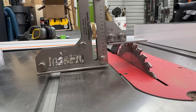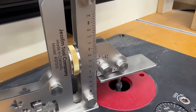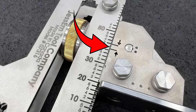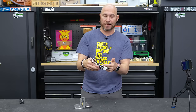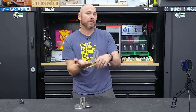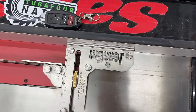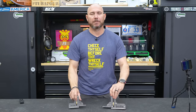These are setup gauges to set up table saws, band saws, routers, and router tables. You set your blade heights using the bottom of the blade on your setup gauge, because this has two different indicators — one for the bottom of the blade and one for the top — so they account for the thickness of that. You can set your gauge wherever you need it depending on what side you need. The bottom of the gauge is used for setting bit heights and blade heights; the top is for setting fence distances. I'm glad they have both of those indicators — that makes everything nice and easy.